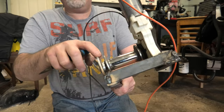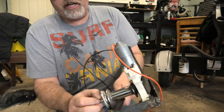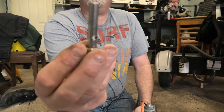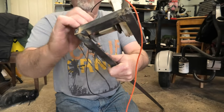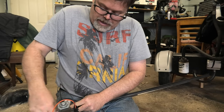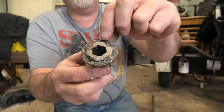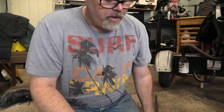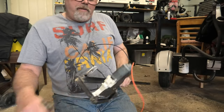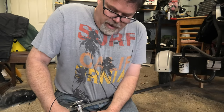Hold on, let me grab my needle nose. So I put a pin in here just to hold that nut in. What I did was pull a little cotter pin — this slides out, and there you go. This was just a bolt that I shaved off and then I drilled a hole through it for a pin. So now if I ever want to change the motor, all I got to do is pull this off. I fabricated this thing: it's a washer that I notched and then welded to a bigger washer, which made my little pulley. If you look at a motor, it's got notches on it — that's what grabbed her. You had to make sure the notches lined up and they worked. It was a little tedious, but the end result is mint.